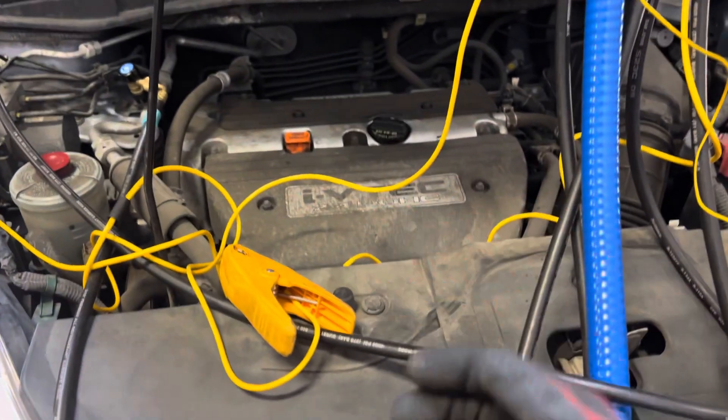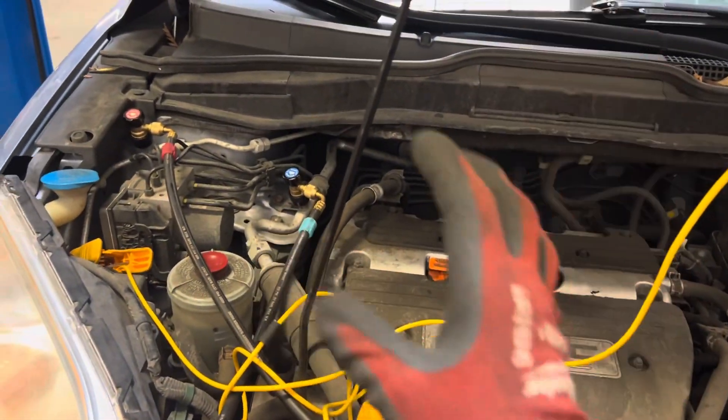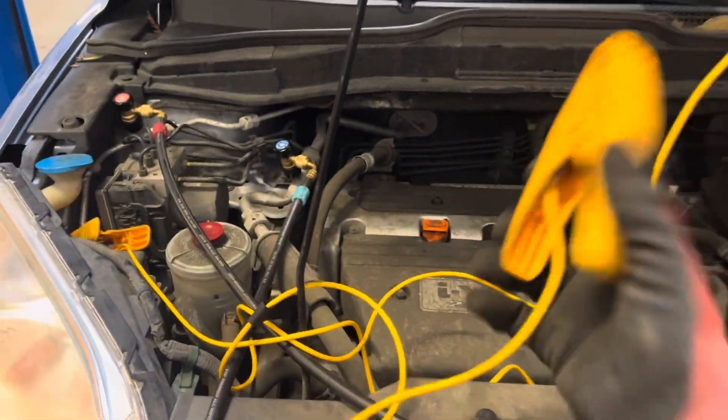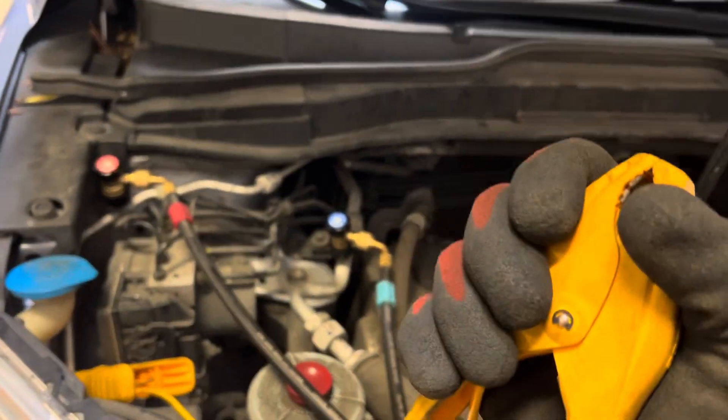As you go along your journey, you pick up heat. The superheat that is closest to reality is right after your expansion valve, because your expansion valve controls your superheat as it exits. But you have to be careful — this plastic can get really, really hot and give you a false superheat reading.